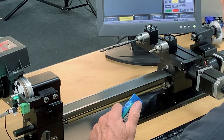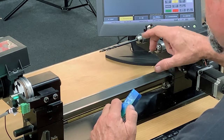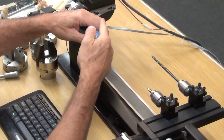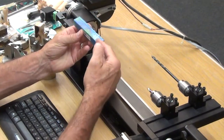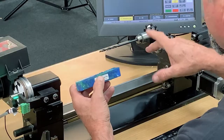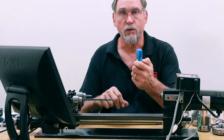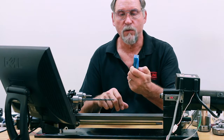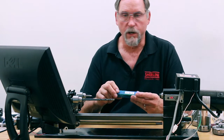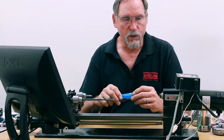I did a program on the Masso. We are doing a center drill first and then we're going to drill. You want a center drill first — if you don't use one and your blank is running out, your drill is going to start walking off center. On a piece this long, you could have the drill actually walk clean out of the part by the time it gets to the bottom. So the center drill is critical prior to the drill. Most people that make pens do this operation on a drill press. We've had some requests for an automated system so that they don't have to spend their time on a drill press doing 40–50 blanks, and this is how we would do it on a Sherline lathe.